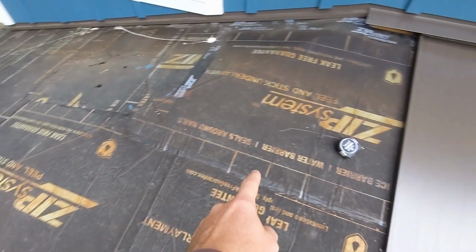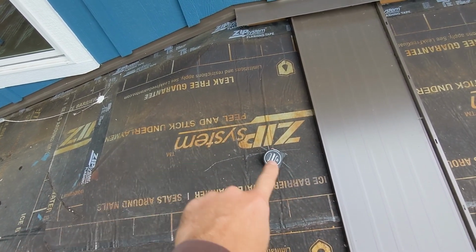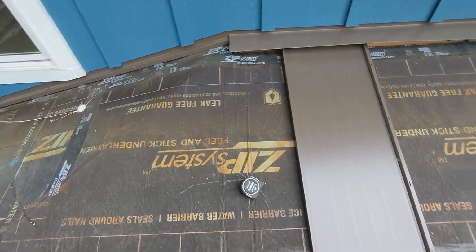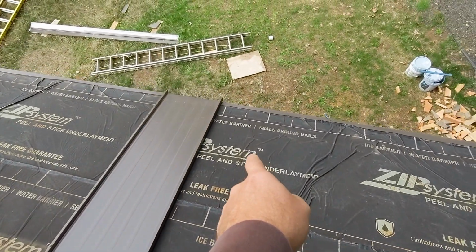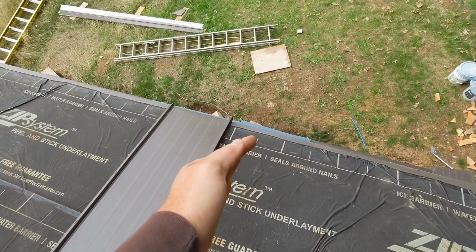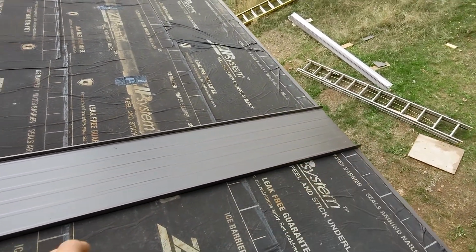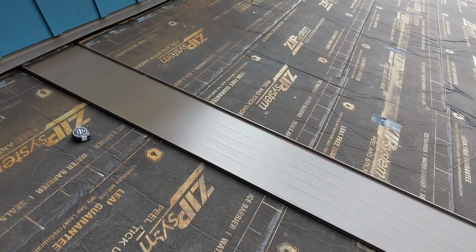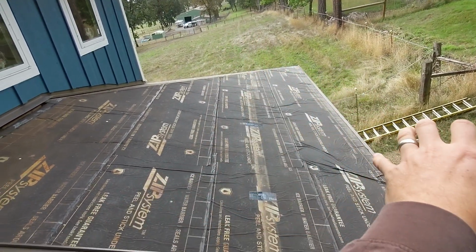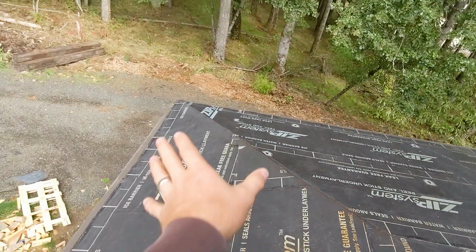and then we measure up to here, and we find the cross section where it comes through and touches. That cross point is the top of the line. And then this first data point here is the bottom of the line. If we edge against that with our first sheet, then everything that follows, we measure over and mark, and then measure over the same distance and mark. If we do that, then everything should flow this way and stay aligned to the building and to the roof, and everything over here to the corner should be the same.